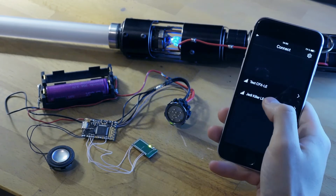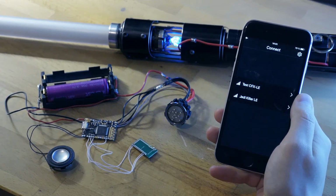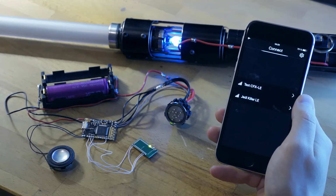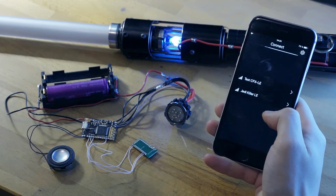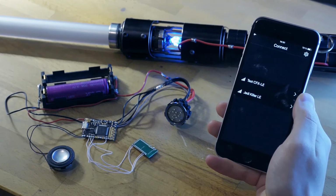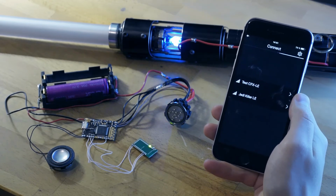And for BT630, the smallest Bluetooth model, you can't change name and passcode in older module versions. You can only do it with the latest modules that have a firmware 2.0 version. So keep that in mind. And if you can't set up name and passcode with the BT630, then you can directly contact me on Facebook and I will guide you through the firmware update for it.